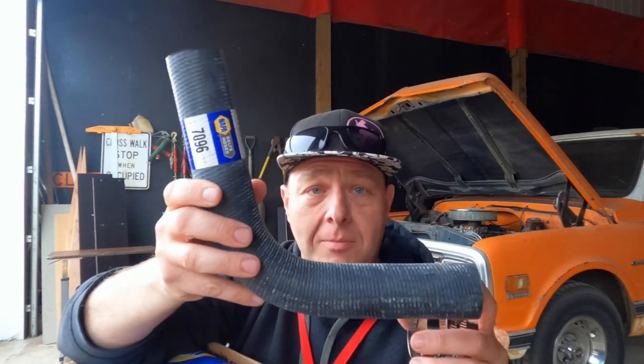There's a Webasto diesel heater built into this bus from the factory - a very large 80,000 BTU unit. It's designed to heat the engine coolant and also preheat the heating system inside the bus. It's a little old and decrepit, and the burn box is a bit rusty. There's a coolant pump that pulls coolant from the engine through the boiler and into the heating system. That pump has a vane-style water pump head and the seals are worn out, so we're going to bypass it.